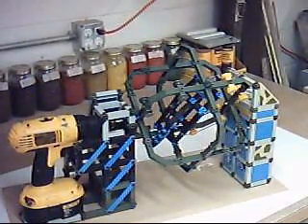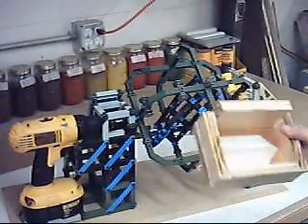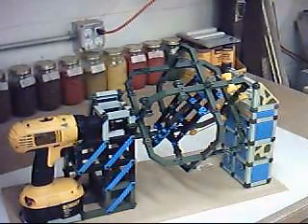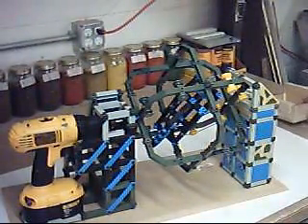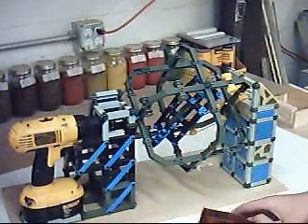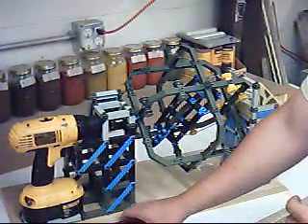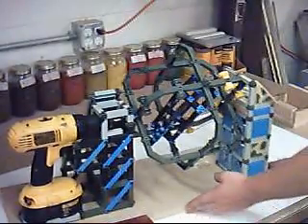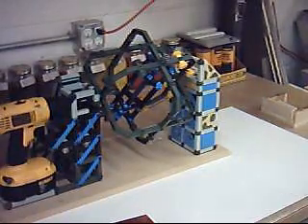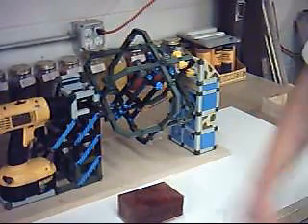The other piece you'll need to be able to do this is of course an original to make your mold from. In my case, I just happen to have access to a rapid prototyping machine, but you can sculpt your own out of clay or whatever material you'd like. Put it in a box and make a simple mold that way. I just have a two-piece mold that uses some rubber bands to hold it together. You will need to find both centers of gravity for your mold, which is really easy to do — you don't have to be super precise. It can be as simple as setting it on a block and going back and forth until you find where its center of gravity is.